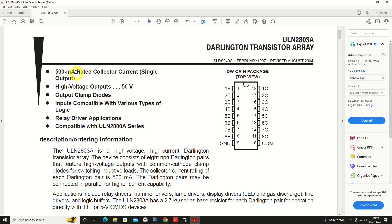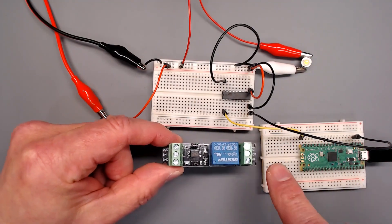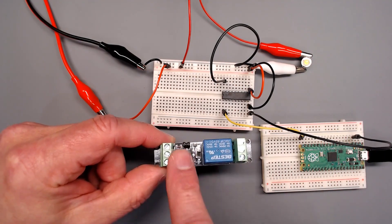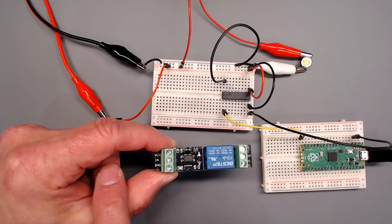So we've got a much higher current rating and higher voltage capability — it can deal with up to 50 volts. It's got output clamp diodes to help redirect current to go the way we want it to and not back into the Pico. It's commonly used in relay driver applications. Often in the maker world we consider this whole module a relay, but in truth, this blue thing is the relay. Everything else here is supporting circuitry to prevent damage to the Pico on the logic side.